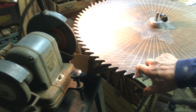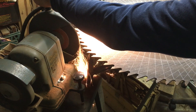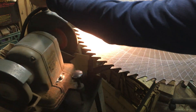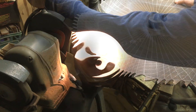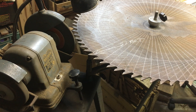I think my support pin under there has kind of vibrated loose. I've got to tighten that set screw up a little bit — it's allowing too much vibration and I think I've walked just a little bit. So there you have it — we've actually cut the gullets out on every one of the teeth. Never even counted the teeth, but those are already done. Now I'm going to adjust to where I can shape the front of the tooth. All in all, I'm really pleased with how the old Bell Saw performed.